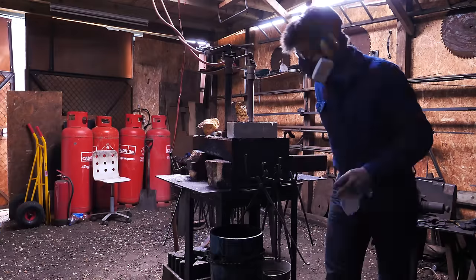So I've lit the forge, and I'm going to bring it up to 850 degrees Celsius or so. Give this 2 normalizing cycles. I've already done 2 normalizing cycles yesterday after the forging. I'm then going to go into the quench. When I go to the tempering oven, however, thank you very much, guys, for reminding me of this, these knives are meant to be extremely hard, so I'm not going to temper it very far.